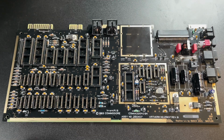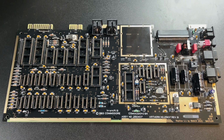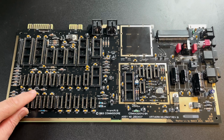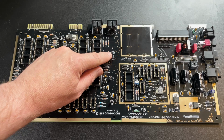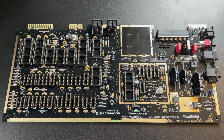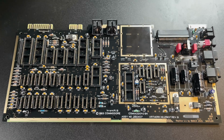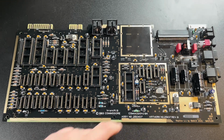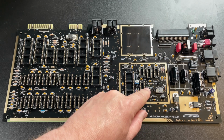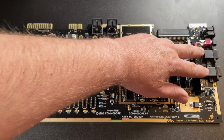I had to replace R31 as it's a 180 ohm resistor on the revision C boards, but it's 1K on this board. C204 is left empty on this board, and C203 can be left empty too. Some of the capacitors are ceramic caps on the Rev C, but are electrolytic on the Rev B, such as C12 here. Here's that lovely old crystal I mentioned earlier. C70 is also different between the revisions, and the joystick ports, of course.